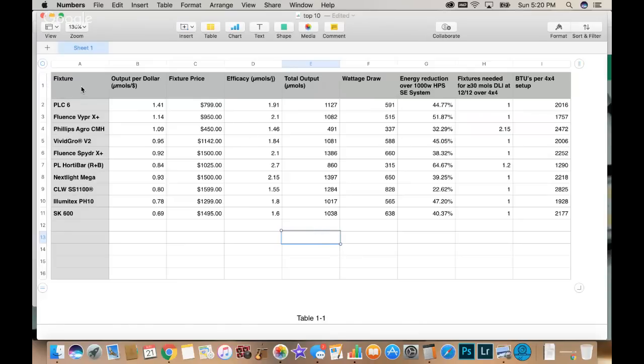They're similar fixtures in the sense that they are using the same components. They're using Samsung S6 bins, as well as, do we know what reds they're using? Are they still using Osram Hyper Reds? I believe so, I've got some here. Anyway, same spectrum, same components, just built into a slightly different platform. A single platform, not as many heat sinks, not as many components and connectors, all these things add up to a more economical build, which in turn is a more economical price for you.